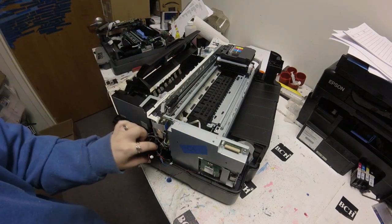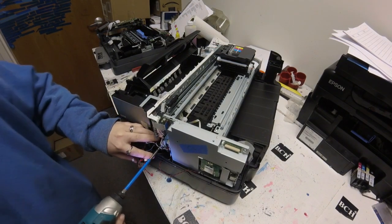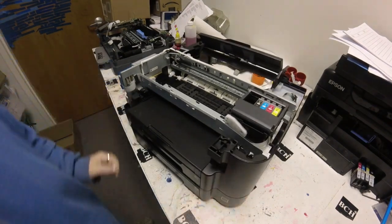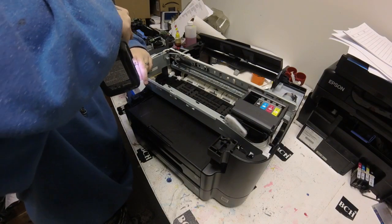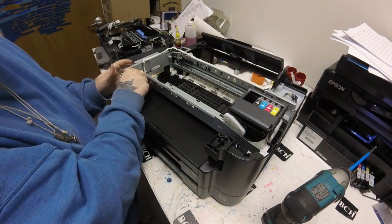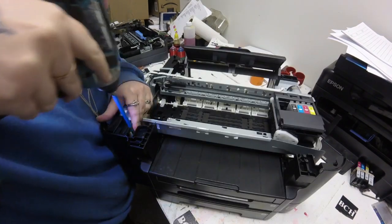I'm going to focus on trying to put some of my screws back in. Here I am moving some of my wires out of the way so I can focus on putting my bottom ground wire back in. There I'm putting that deep screw in and putting that thin FFC cable back. Here are those front screws in the front of the printer that hold the mainboard in — one facing down and one facing more into the rail. Once we put those FFC cables back, we'll put the side cover back on and put that deep screw back in to hold it in place.